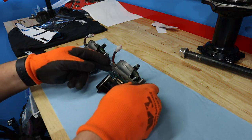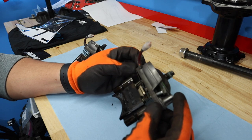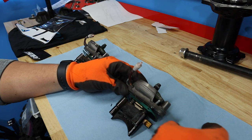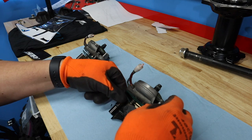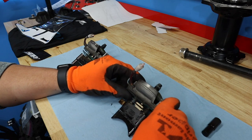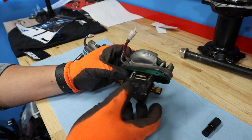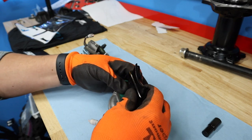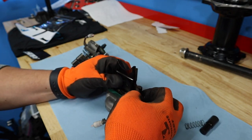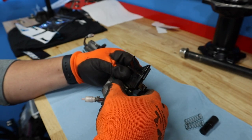Let me show you how to take this apart — it's pretty simple to disassemble. I'm going to take this apart with my hoses being up and pull this side off, set it over here, pull the other side off, set it over there. This is a two-piece plate that comes apart right here, but in order to take it off you've got to get rid of these springs. The springs are obviously going to be symmetrical — just pop them off, nothing to it. And then it's automatically going to retract because there's no more spring pressure on it and that diaphragm is doing its thing.